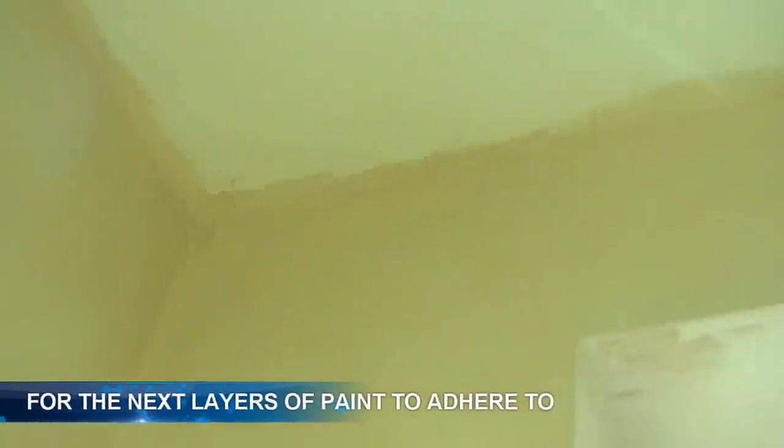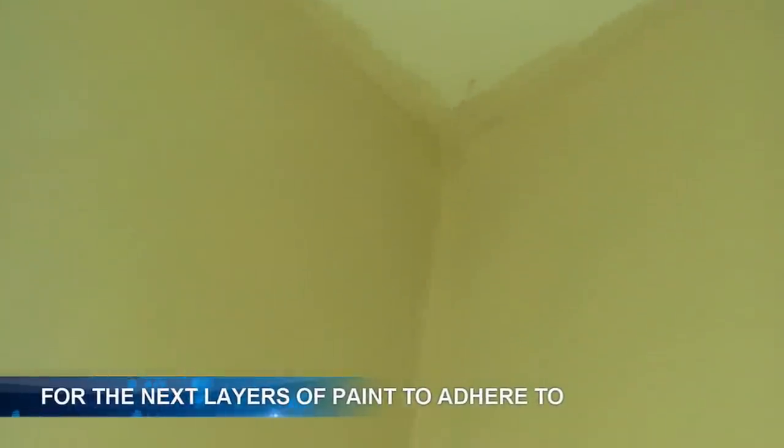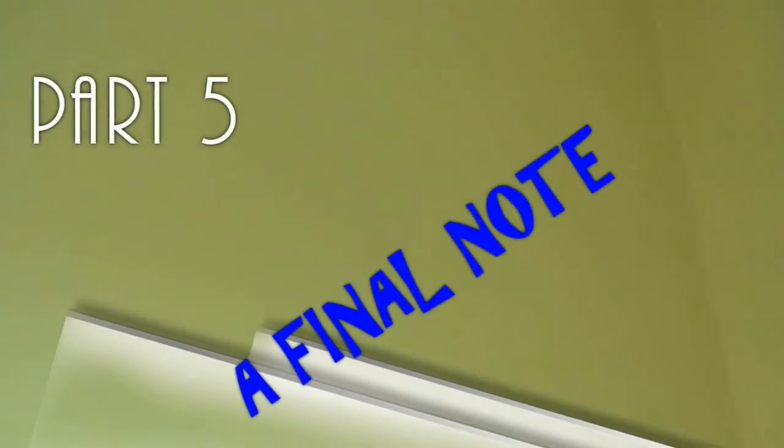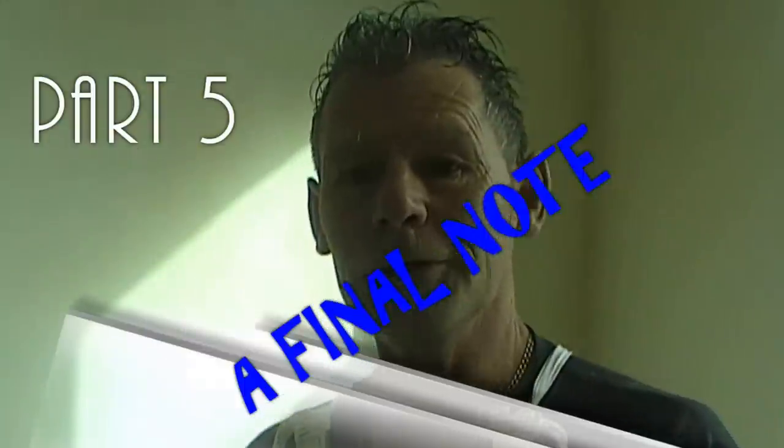Obviously we're going to paint the ceiling as well white, but I just wanted to show you. So use caulking along the edges, get a nice tidy finish, so it'll fill any cracks and uneven areas right around the perimeter and the edges from wall to wall. And then once that's dry, then you could put the normal coat of emulsion on, which I'll show you quite shortly. A couple of pointers.